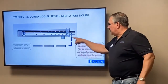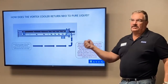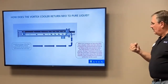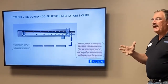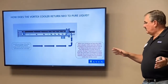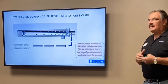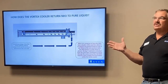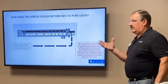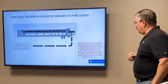There's what's called an orifice here — it's compressed down to three-sixteenths of an inch. The older coolers have a long tube that's three-sixteenths of an inch. When you compress or force NH3 into a smaller orifice and then allow it to expand, the pressure drops to near zero PSI. In that zero-pressure state, the NH3 flashes or cools, and it gets almost 28 degrees below at that flashing point.